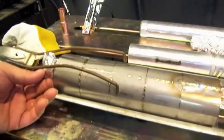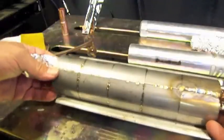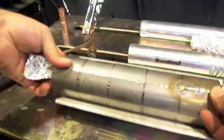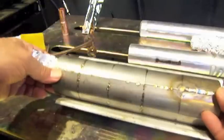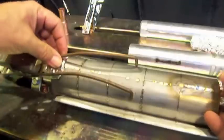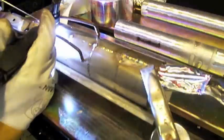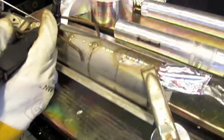Now we're going to try to use that piece of copper tubing for that long seam, for all those seams that are lined up. It's just crimped on the end — you could weld it, you could solder it, but it's easy just to hammer it shut on one end and line it up. Make a trough out of aluminum foil — several layers of folded aluminum foil mashed in there to make a nice little trough. Then we're going to use that same pony clamp with the pieces of rod welded on it to hold it in place. With the split tongs on it, it lets us get in there. We'll hook up an argon hose to the other end of the copper tubing and then zip it up.